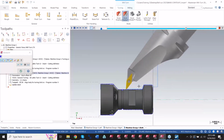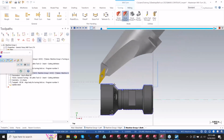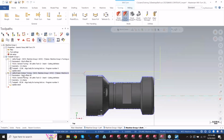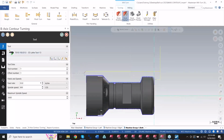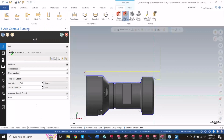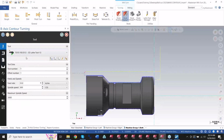All right, if I didn't want to use a grooving tool to get all this down, I can use this tool here. How this toolpath works is I would go into the parameters of this toolpath and pick the tool that I'm working with. This is one of the newer lathe menus. They introduced this style of menu when they came out with the custom thread option a few years back, and they started making the newer toolpaths with this style. But it's all the same stuff.